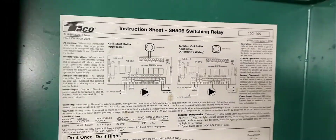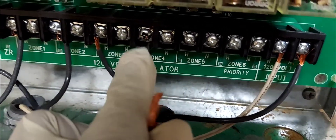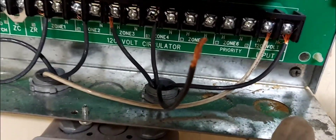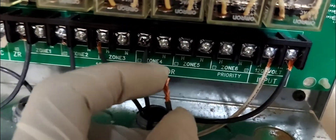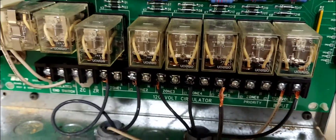There's a schematic wiring diagram on this panel. I'm going to show you — here's the blown fuse for zone five. The wire is disconnected; I pulled it out. It was connected on zone four, and the neutral is already spliced so only the hot wire was needed. Zone four is on this one; zone five is right here. And here's the fuse — it's blown.